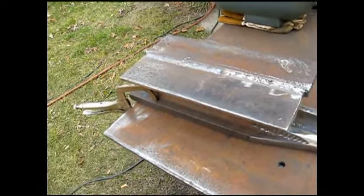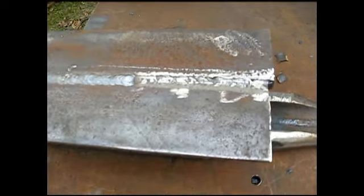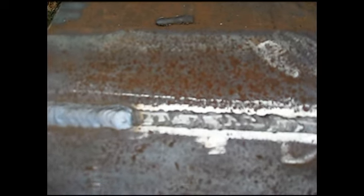Here's another little update — welding off the bottom. In this channel groove I just used a really deep penetrating rod, kind of veed it out just a little bit. And then over on this section I used some 7018 to cap it over — a pretty easy rod to use. I'll do a stitch and show you what happens to the flux. Unfortunately I can't show you while I'm welding because I don't have anybody to hold the camera, and you wouldn't see anything anyway except a big flash. I'll just show you when I get done.